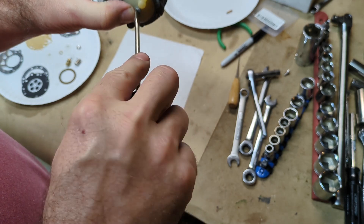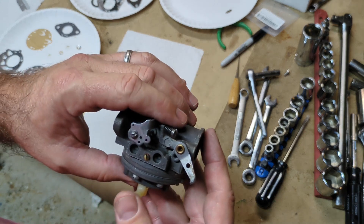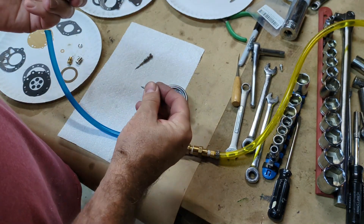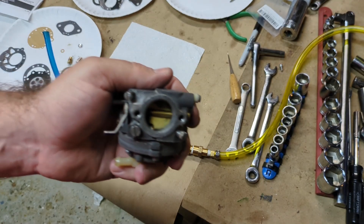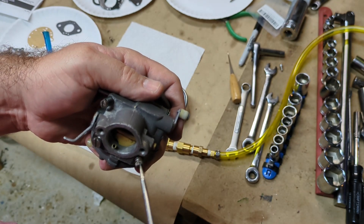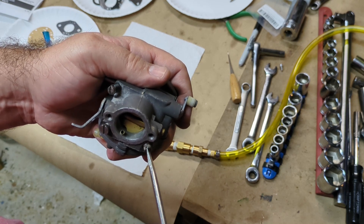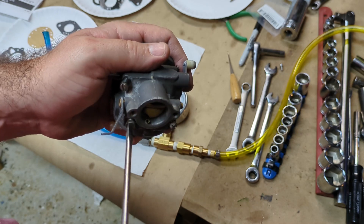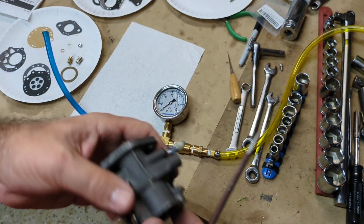Don't have to over-tighten this — it's just plastic with a cork fitting. We're going to go ahead and put our speed screws in. What you want to do is bottom these all the way down until they stop — you'll feel them — but you don't want to tighten them too much, just until they stop. Then we're going to back them out. I'm not going to mess with them right now — they're both going to be down in there.